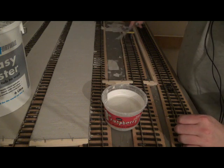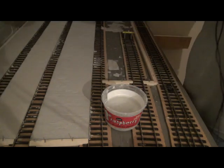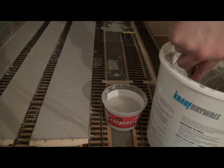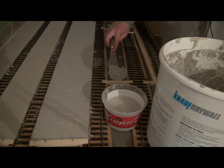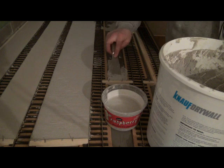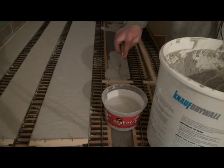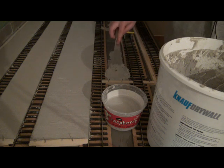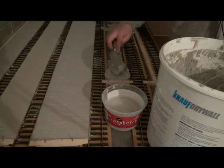The PVA is quite tacky now, so I'm going to drop some plaster into here, being careful not to damage the area I've just done - that's all been smoothed out now. It's going to sink, so I'm not looking for perfection in the first pass. I just want to fill it just below the height I want it to go to, then I'll go back and fill and tidy it all up because it will sink once it dries. Remember this is a finishing plaster, only supposed to be a couple of mil thick, and I'm asking it to be 12mm thick, which is quite a lot deeper than what it's designed for.